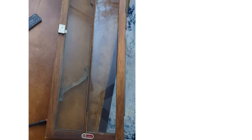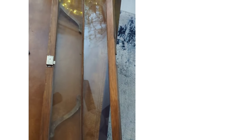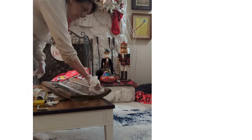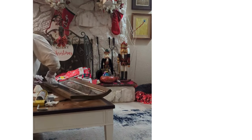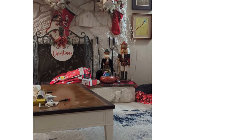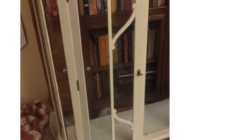Once I had the doors inside, I figured out that the molding holding the glass in place was crumbling — just like Oreo cookie crumbs. I tried to take out the window but turned a little chip into a crack. I just said heck with it, took window caulking, and caulked the glass into place with the crumbled molding, hoping it wouldn't interfere with the painting process. I reassembled the piece, and this is what it looks like with three coats of that paint. It's still missing that middle window — there's the crack — but we'll fix that.